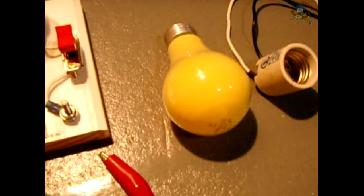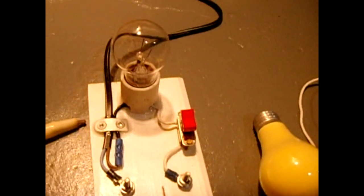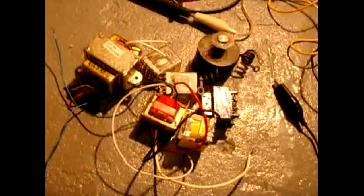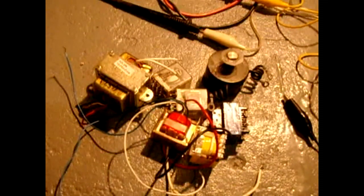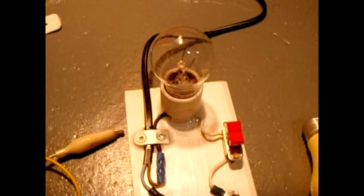In this case it's a 40 watt light bulb; the resistance is higher than this 100 watt light bulb, which is around 10 ohms. In order to use the circuit you have to size the load lamp according to the load that's being tested — that could be a solenoid, transformers, relays, a switch mode power supply, a DVD or VCR, any circuit you want to test. You want to make sure you're not going to burn out the components under test or blow any fuses, so for example if this is a 15 watt transformer then you would want to use approximately a 40 watt light bulb.